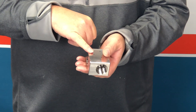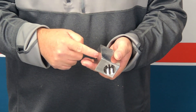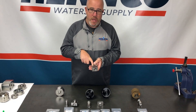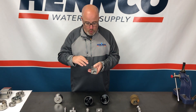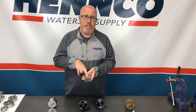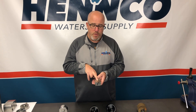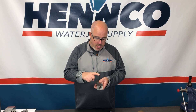In this style valve body, it's a hard plumb of the high pressure line directly into the valve body. So if we get a leak coming out of this weep hole, we know that it is a bad connection at the valve body — let it be the tubing or the valve itself. The bottom weep hole is probably the least likely to fail, and this is basically the weep hole for the connection between the valve body, the seat, and your down tube or adapter.